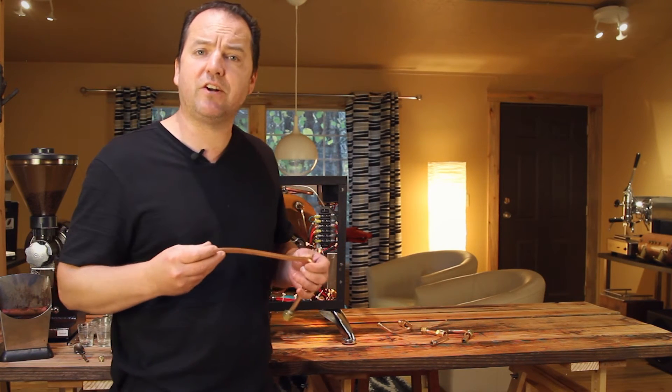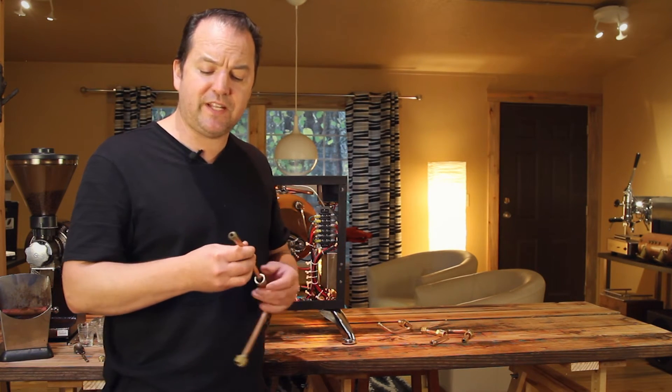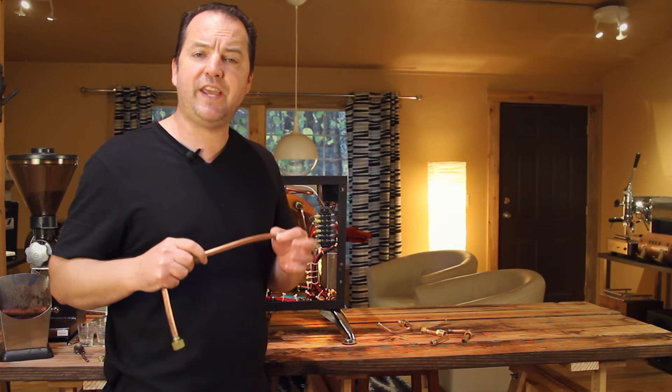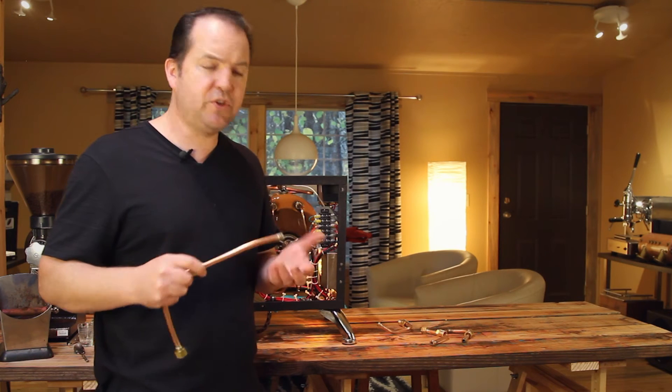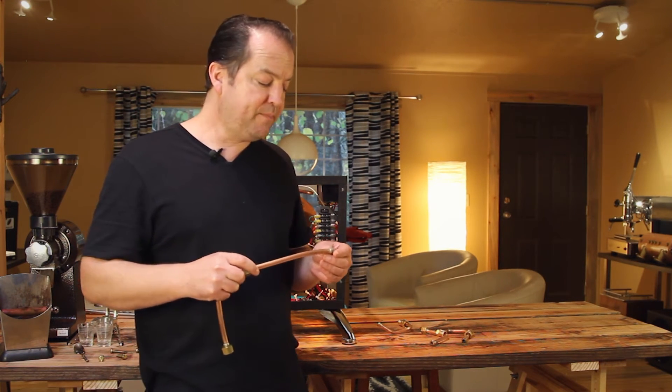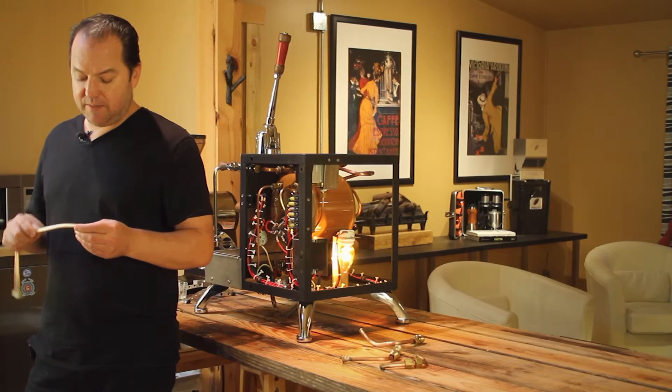What they are is a British standard pipe fitting — a very specialized fitting that's been hand-brazed. All of the ferrules on the ends are actually hand-brazed with silver solder. We use a 55% silver which flows very nicely, is very reliable, and very durable. Very expensive, but it is the best.